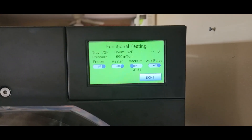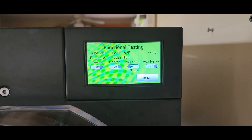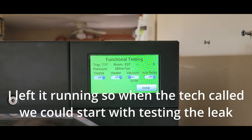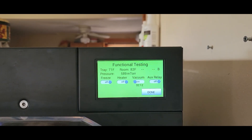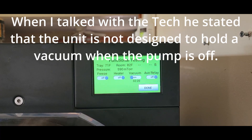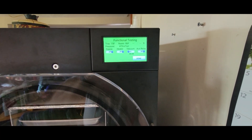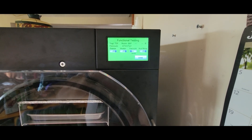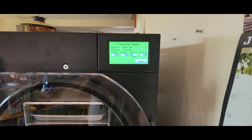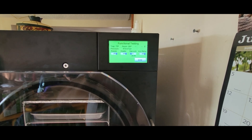We've been running for about 32 minutes and it's still dropping, just really slowly. We're going to let it run for about an hour. I'm expecting if there's still some kind of leak, the vacuum will start increasing when I turn the pump off — which it should not be doing. At the 25-minute mark we're down to 475 millitorr; it should be getting down to 100 to 300 range.